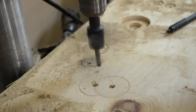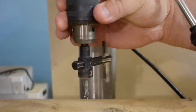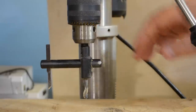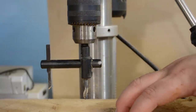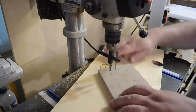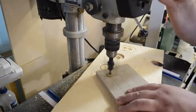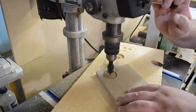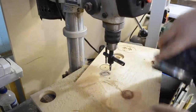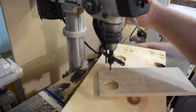One thing worth noting on these circle cutters — machinists refer to this kind of process as fly cutting — it's offset, so don't think you can hold a work piece down with your hand when you turn it on, because it's gonna swing around, bite you, and that's just no bueno. Then it was just line up the pilot bit on the drill press with those center punch marks. MDF is not good stuff to breathe in, so I tried to rest my dust collection hose here — probably another project: an articulating arm for the dust collection hose, but we'll save that for another day.